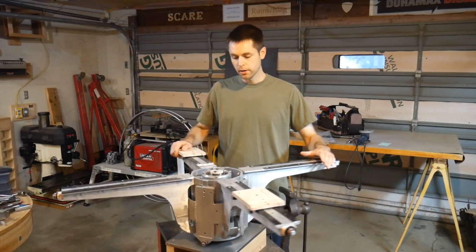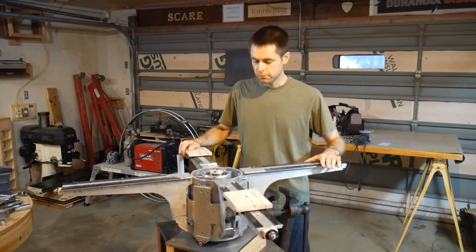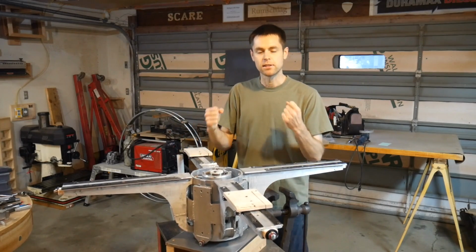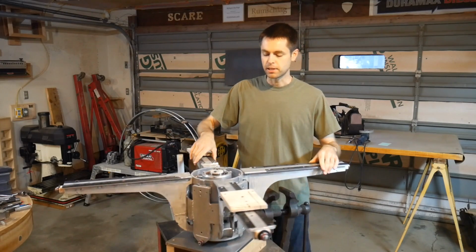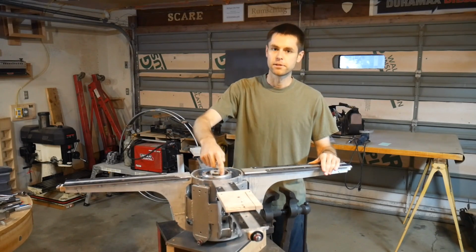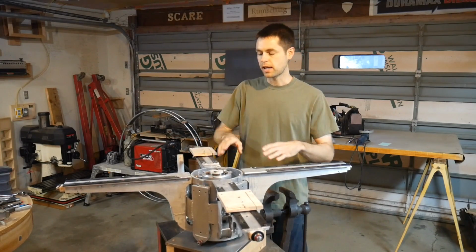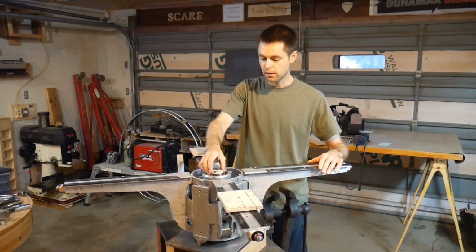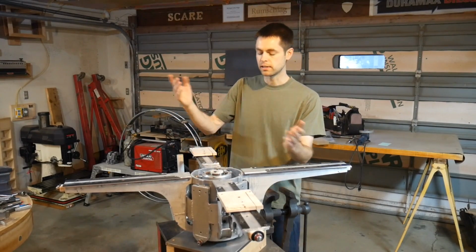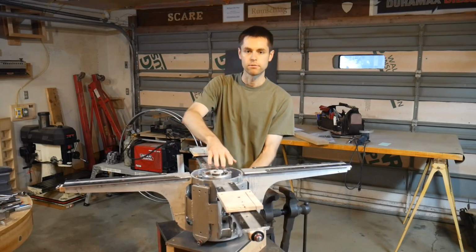So those are the things that we're looking for. And the most core motion, the one which has to be absolutely the best, the most locked down and have as little play as possible, is the rotation, because everything rides on this shaft. Whatever play you have in here is going to stack up into the other parts, and being in the center and on a narrow shaft, it's also going to get exaggerated just due to the leverage difference here.